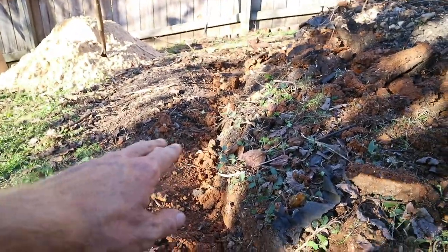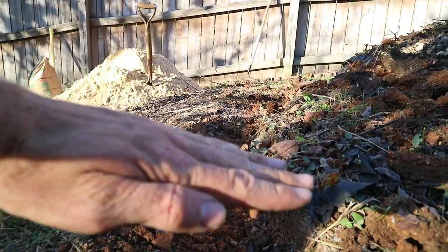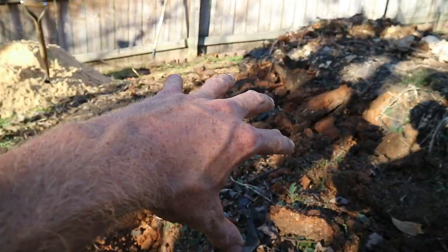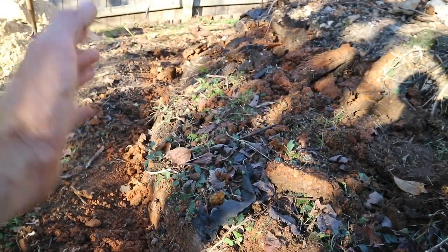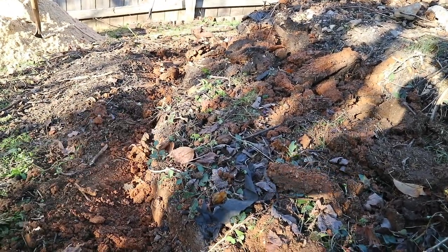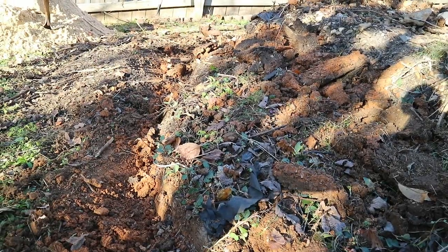As I'm cutting this out, I'm keeping it tilted back towards itself — just a tiny bit — so that when I backfill with gravel and soil, that pressure is going to push on the wall. With it being tilted backward, the pressure of the backfill makes the wall firm and strong and able to hold weight. If I made it straight up and down and then backfilled, it would tend to bow out more and eventually collapse.